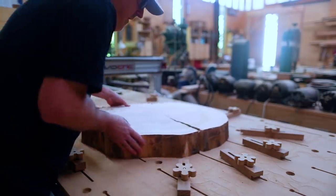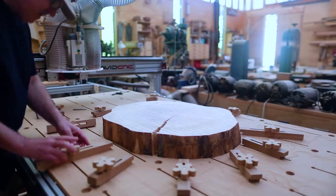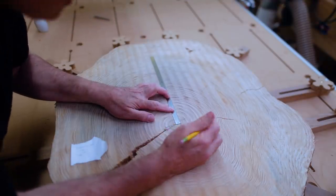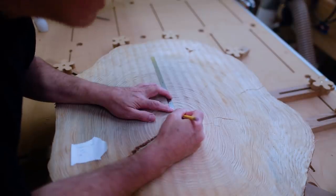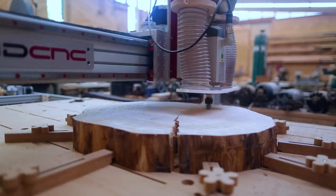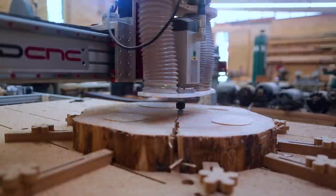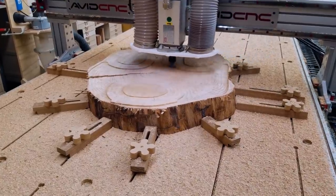I tried and could not figure out how to rotate the model or G-code in Fusion — I just needed to rotate everything 90 degrees — so I ended up rotating the piece of wood on the table instead. I had to find my zero-zero point; using the photo in Fusion I could tell where that point was and find it on the actual piece of wood. It didn't have to be super perfect, just pretty close. Then I started the roughing pass with a one-inch bit, cutting out most of the mass of the wood. It moved pretty fast but still took maybe an hour to 90 minutes.